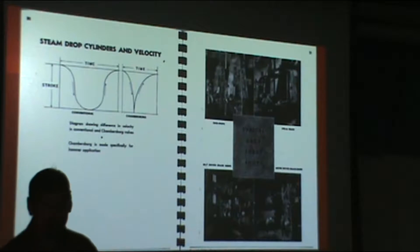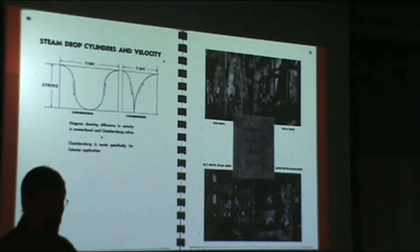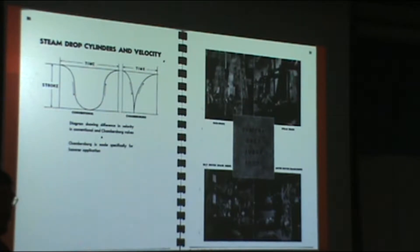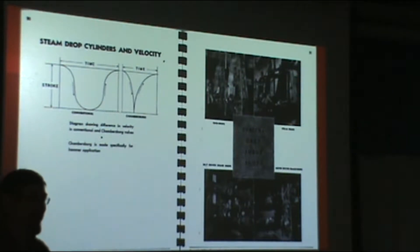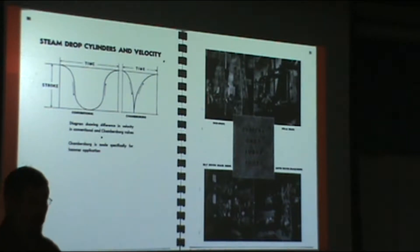The lubricant also helps the metal flow into all the bits of geometry, and it cuts down on wear. In a closed die shop you're going to have a lot more actual physical wear because the oxide layer on the part interacts with the tooling, eroding it over time. In an open die shop, tools undergo thermal fatigue and washing out — where the die working surface can turn red hot and deform if it's not high alloy material. In closed die, dimensions will change and you'll have to repair or remake the tools; I've heard three to six thousand pieces is a typical range.